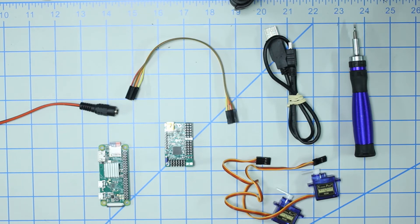Let's talk about the power options. The board needs power as well as the servos. They show you different wiring schematics so you can run everything on one power supply, but that's not ideal. In this tutorial we'll cover how to set up a separate power supply for the servos, and we'll be communicating to the Raspberry Pi via the TTL serial interface. I initially tried to connect via the mini USB serial interface but that was problematic on the Raspberry Pi side, so TTL via the GPIO pins works well as an alternative.